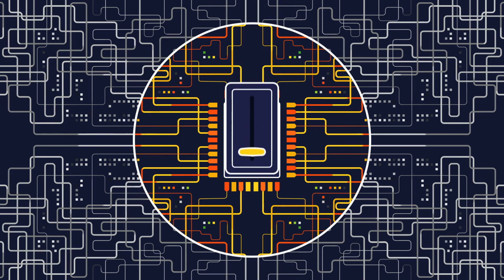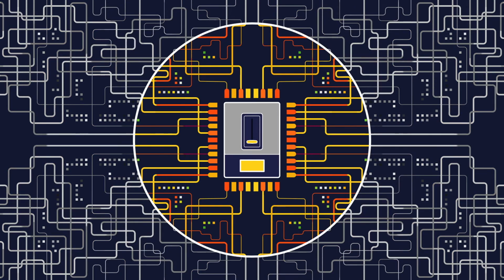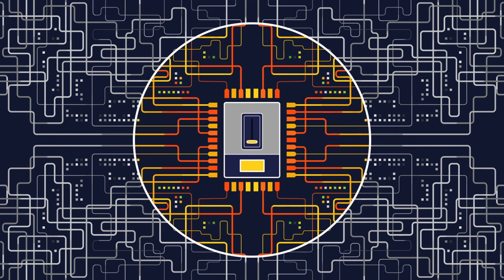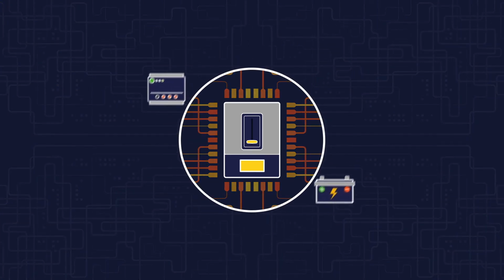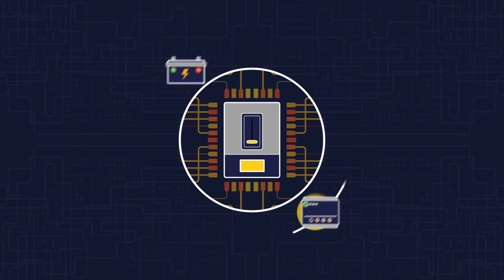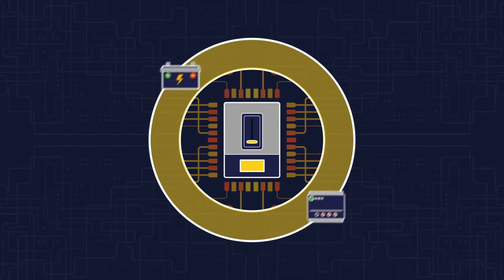As with the inverter circuit, the isolation circuit uses switches to connect or disconnect the inverter to and from the grid. It is because of this isolation that inverters don't supply power during blackouts unless they are specifically equipped to do so. Only inverters for battery-equipped systems are configured to provide power to selected circuits in blackouts.